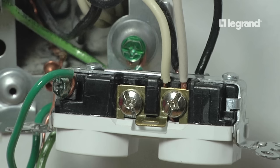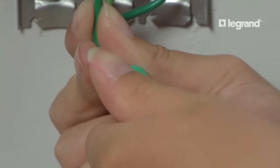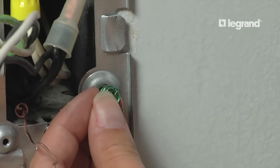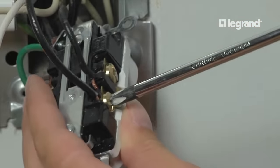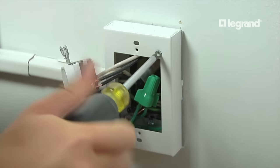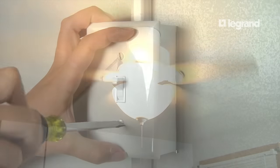Remove the existing ground wire from the green ground screw on the receptacle, then cut two six-inch lengths of new ground wire and create a pigtail with those two wires, the old ground wire, and the wire leading through the raceway up to the switch, using a proper sized wire nut. Connect the remaining ground pigtails — one to the ground screw on the receptacle and the other to the ground screw on the starter box base. Attach the new black and white wires to the screw terminals next to the existing black and white wires: white next to white and black next to black. Once the wiring has been fed to the boxes, secure the box covers to their bases and attach the faceplates with the screws provided.